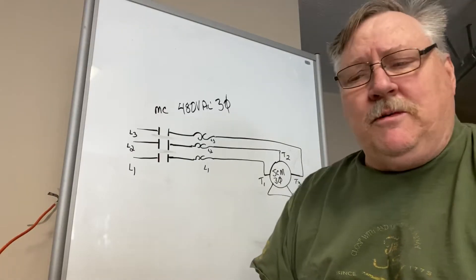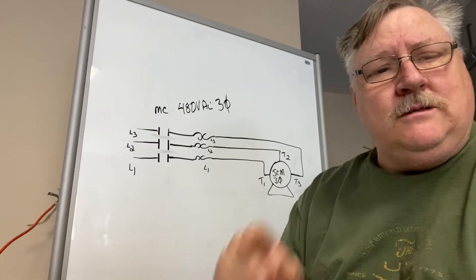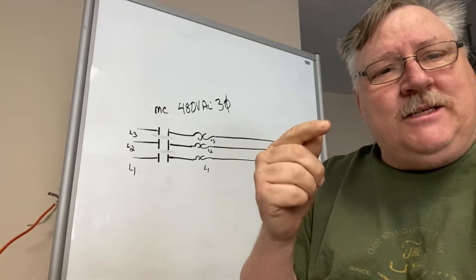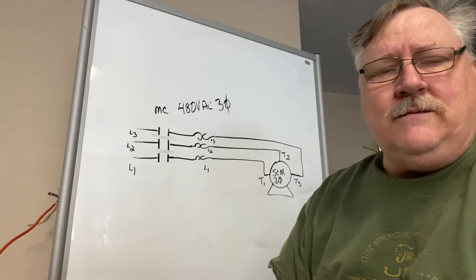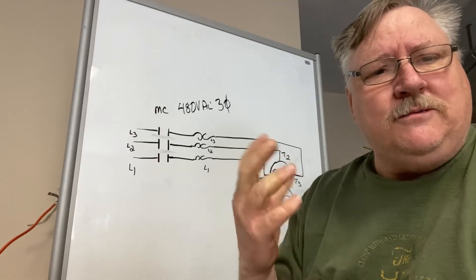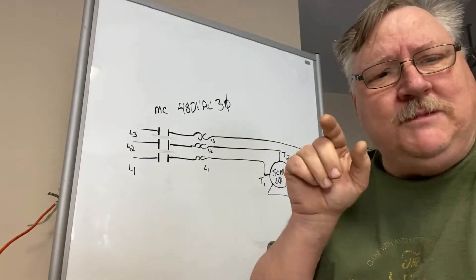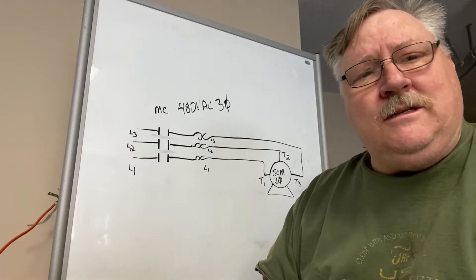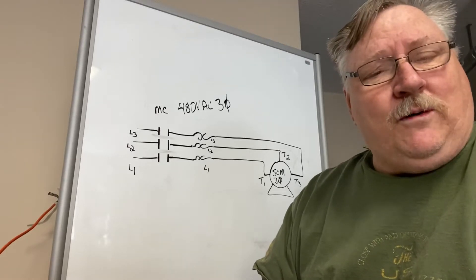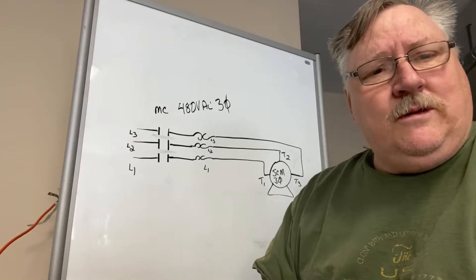When you're troubleshooting a motor, the first thing is check your overcurrent devices — period. Check your overloads. There's a little reset button, and on that reset button it can be turned to A or H. A means it's automatic, and you don't have that too often in manufacturing, because anything that an operator interacts with on the machine should not automatically restart after there's a fault. So those get put on H, which stands for hand, which means you have to manually reset that. That's going to be a maintenance person or a technician who has to come and open the cabinet and see what the fault is.